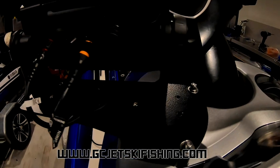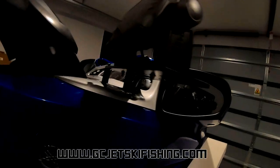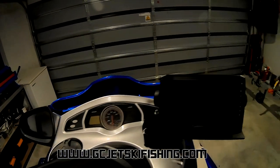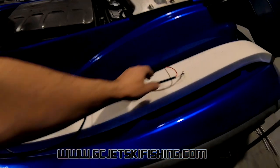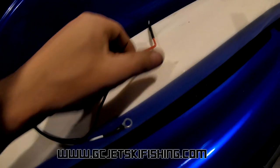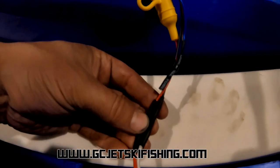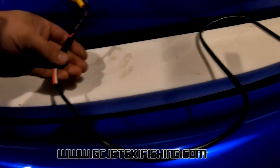The unit is now all bolted up and plugged in — not a bad, nice tidy install. One thing I don't like about Garmin units is they don't give you enough loom on the power wire. I needed about another 500 to 600 millimetres, so you can see I've added battery terminals, soldered them on with resin core and heat shrink. I've done the same for the join up here, and also sealed the wires we're not using. We'll install that and then it's done.